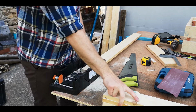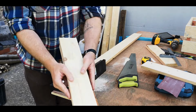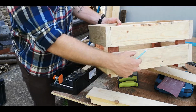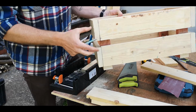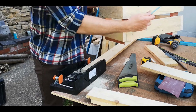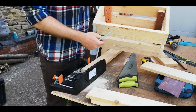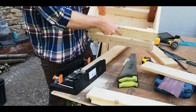Now, because I've noticed these that have come off are actually slightly smaller in width, I want to make sure all one row is the same timber, so it's the same width, so when it gets to the edges it meets up quite nicely like that. So I've cut 2 long ones out. Now I'm going to cut the short ones that will go either end out of that same timber, so when I do screw it up I'll make sure that they're all running round. You'll see later.